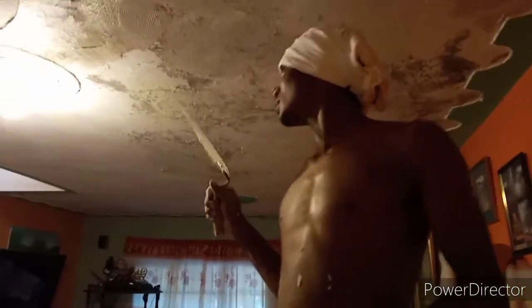So what did you know, sir? Well, as you can see now, look at this side of the ceiling, it flaked off. So we have come up with a new technique. Before, the design on the ceiling was popcorn with sprinkle. You understand? Sprinkle and little sparkly things. But because of the climate condition or weather, whichever you want to put it, they start to flake off and drop off. So we already know our new solution, we use white thin set.